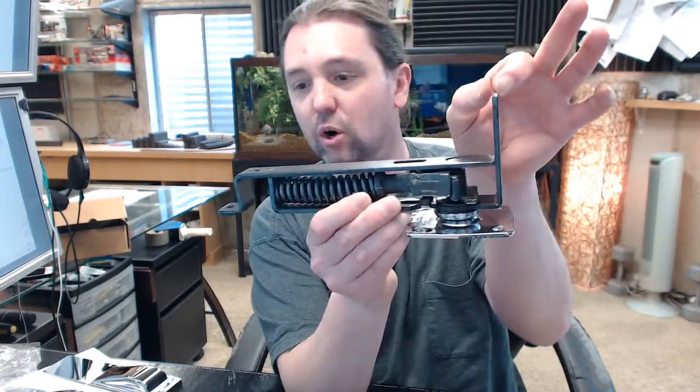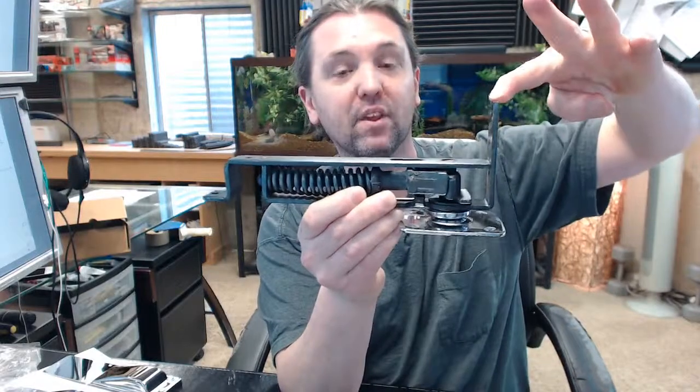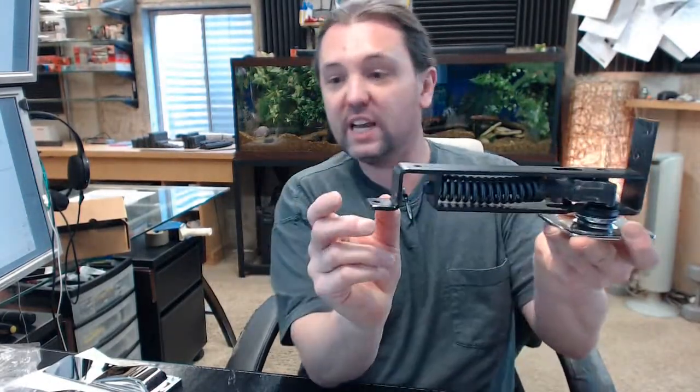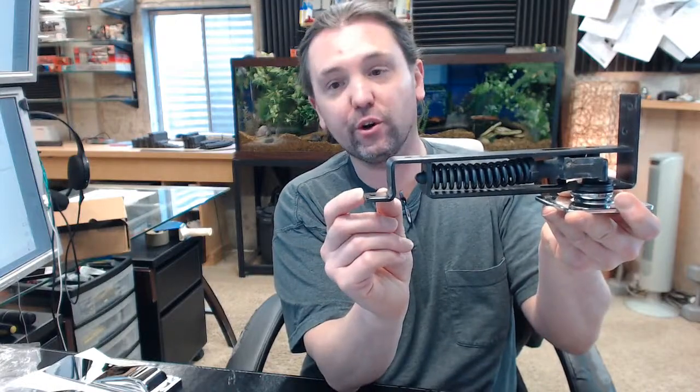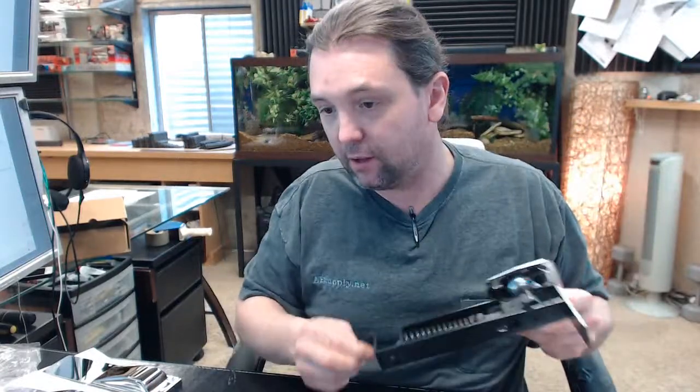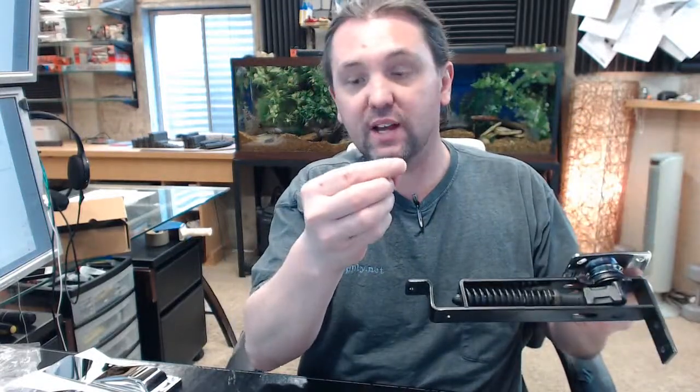So 5/16 over. Bottom of the door to the top of the cutout is 3 5/16. You're going to go an inch and 7/16 up to this area. You're going to take this 13/16 worth ear, and if you look at the diagram below, you have to mortise for this portion so that it's flush. 1 inch wide, 5/32 of an inch deep, and when this plate is flush with the bottom of the door, your installation is complete.